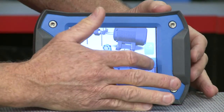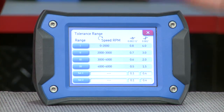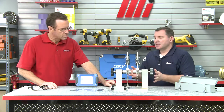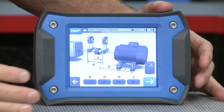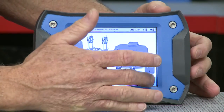Now I have a tolerance range and speed for the machine. It's crucial when you're doing alignments to know the speed, to know how close you need to get your shafts aligned. For this demo, let's say this shaft's turning at 1,200 RPM — that would be selection number one, because that's 0 to 2,000. Now it shows a picture of the machine, so go ahead and select the next arrow.